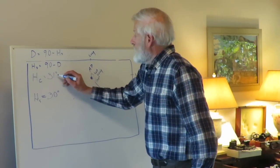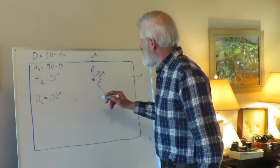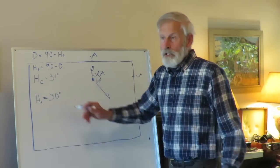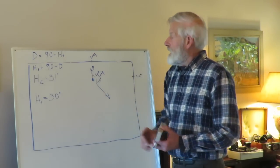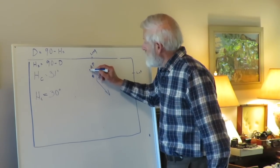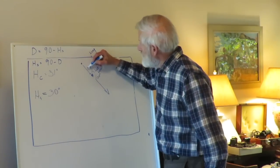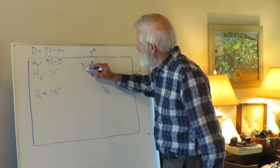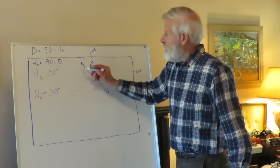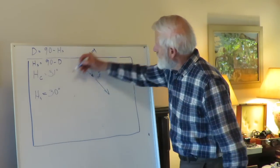So when the height computed is higher, we are farther away because our sextant sight was lower. That means the sun was lower and we're farther away from the sun. So we're not here. Does that mean that we are 1 degree farther away, 60 nautical miles farther away from that point? Well, it could mean that we're there, but remember, what we're defining is a distance from a point, which actually is an arc of a circle.